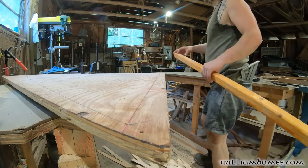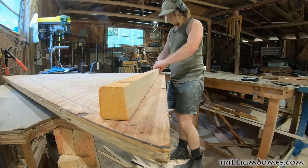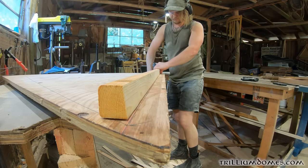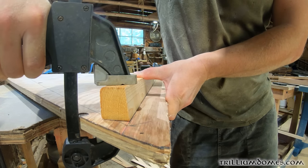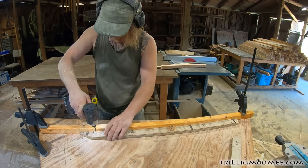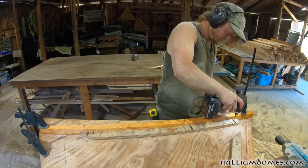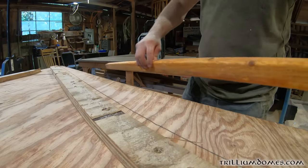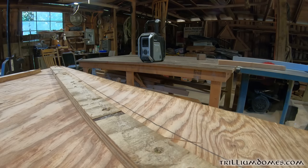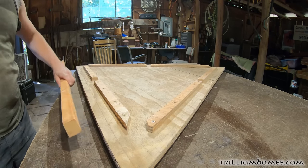So to finish the jig, you're gonna use your strut material that you already have cut so that you're as accurate as possible. Pick a straight piece and set it on the line, wide side face down, and clamp it. Now take another piece of straight, sturdy material and screw it into the jig right up against the strut. Repeat this step all the way around the jig so that when you push the strut up against your backing board, the edge just barely splits that line.